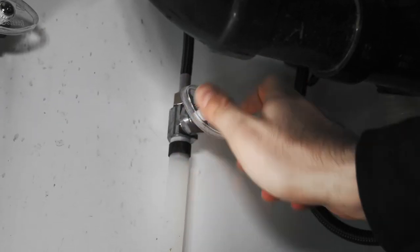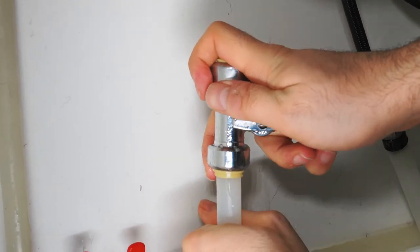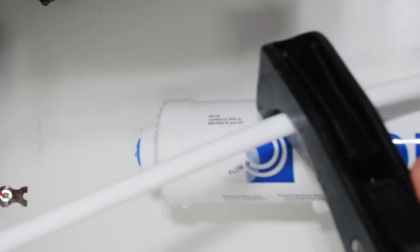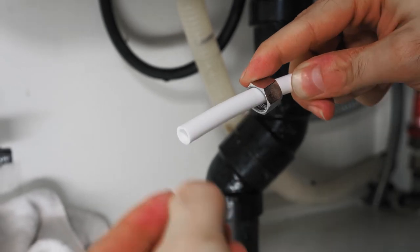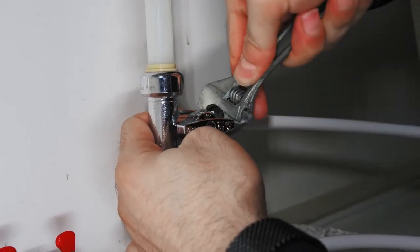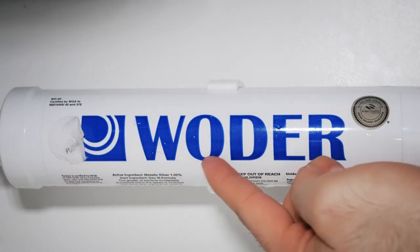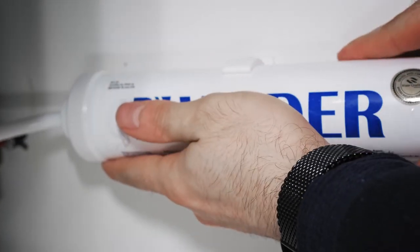Next, turn the cold water line off so it can be cut. When you cut the line, it's normal for a small amount of water to drain out. Take the 1/2-inch PEX to the 3/8 OD T and insert both sections of the 1/2-inch cold water line into the female ends of the T. Cut a length of 3/8-inch tubing that will connect the T to the pre-filter. Feed the compression nut and brass ferrule over the tubing. Insert the tubing into the OD T and use a wrench to firmly tighten the compression nut — the tubing should stay in place when pulled. Connect the outer end of the 3/8 tube into the inlet side of the pre-filter, making sure that the water will flow in the same direction as the arrow on the filter. Push the tube into the filter as far as possible and snap the pre-filter into its clips.